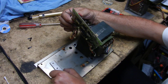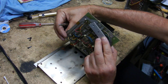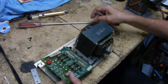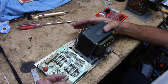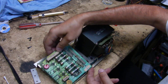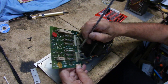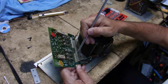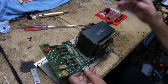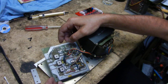See how the others are all missing. The reason they've got that heat sink there is to dissipate the heat across there. This one came out of his Playboy '78 machine - think about it, 1978 and now. It's not bad because the pins haven't all been burnt out. There is a little bit of burning on the plastic right here, but most of the others have heated up because the pins that go in there start making arcing. So now, how do you do the transplant from this old board to the new one?